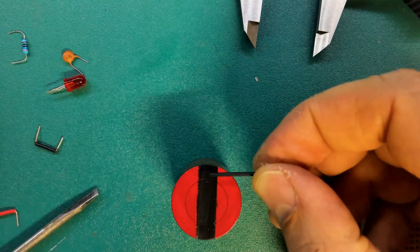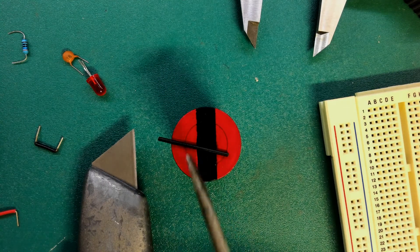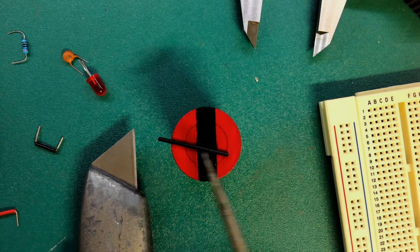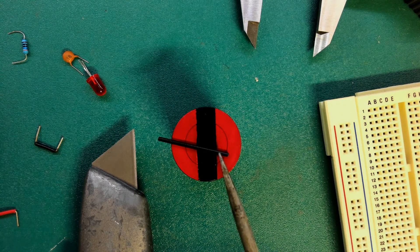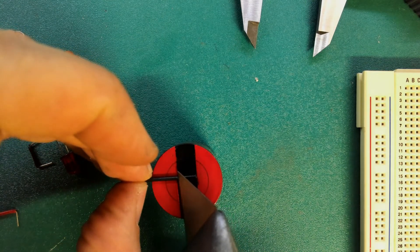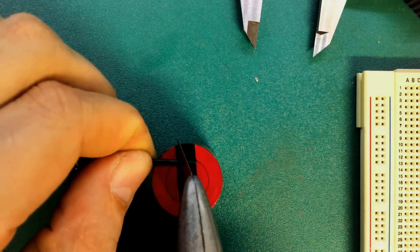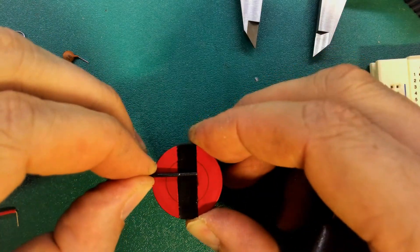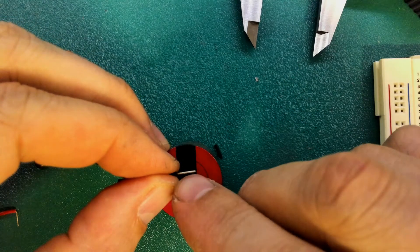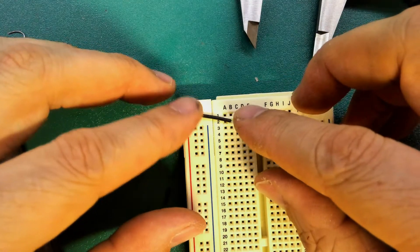But now we need to put the 5mm mark. Here's a little tool I've made, and you can see it clearly has a 5mm mark between these two red sides. I've got my trusty blade here. You need to be careful when trying to cut the plastic sheath off your wire, because solid core wire is extremely easily damaged. If you push too hard, you're going to put a nick in the metal wire, and that's going to cause a weak spot — it's going to shatter over time. So I'm going to lay down my wire, hold it in position, put my little blade over the edge, and very gently roll it back and forth. Once you've made your little mark, it should be easy enough with your fingers just to pull off and expose that 5mm end.